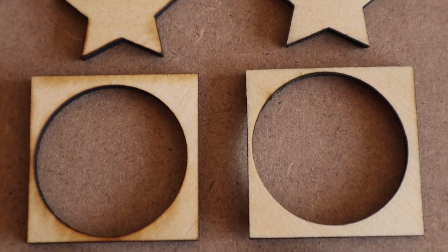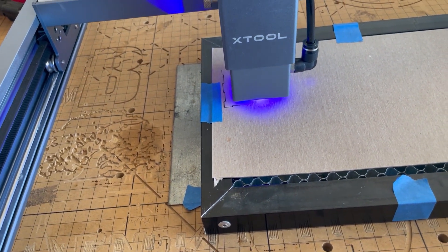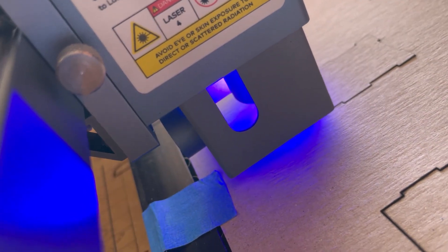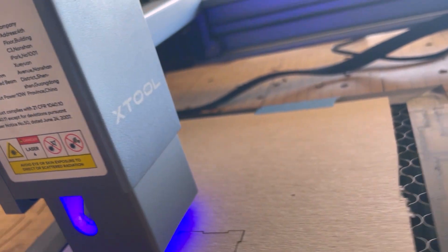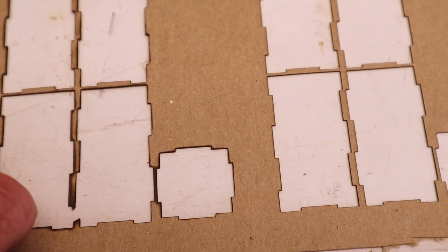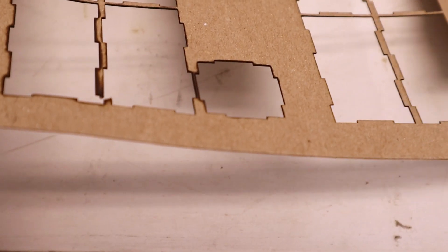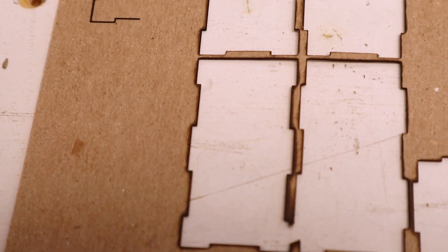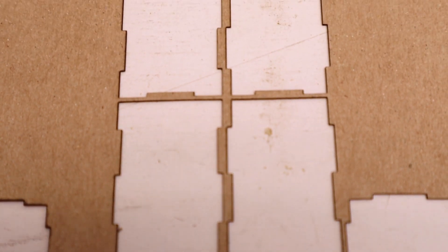I want to do one more test with some cardboard material, just to see if I can get something to flare up and further demonstrate the difference between using air assist and not using it. For the final test, I was cutting out some box joint parts out of really thin stock cardboard sheet — I'm not even sure what this stuff is called, maybe thinner than chipboard. Right there you can see where the cardboard essentially burned and got some pretty bad charring. If I went any slower, I probably would have had a live flame. And then the obvious difference with the air assist.